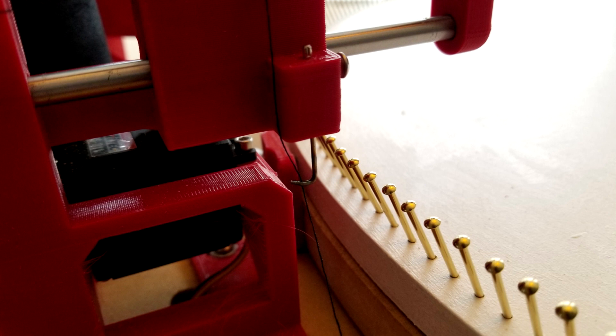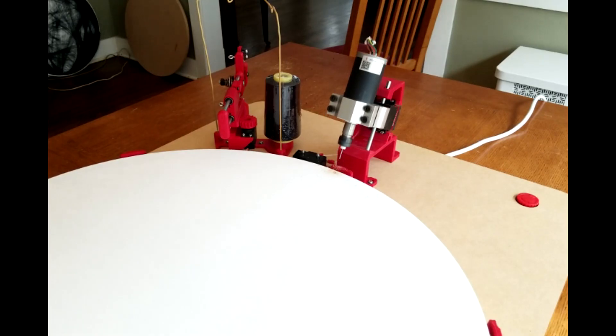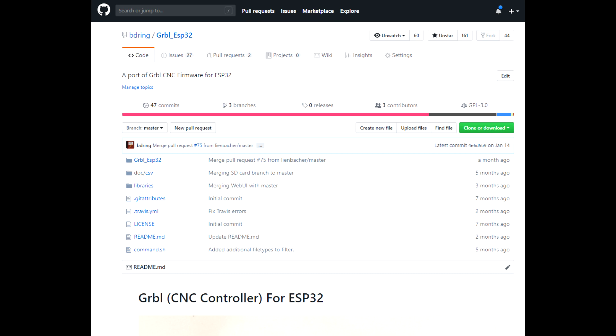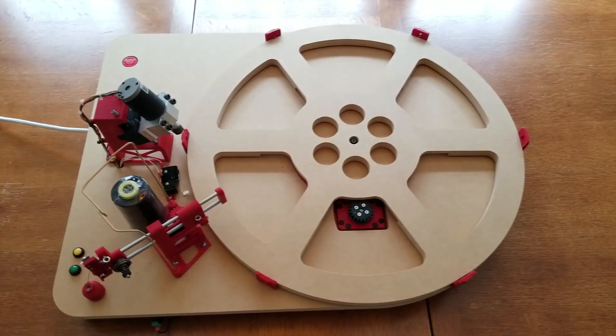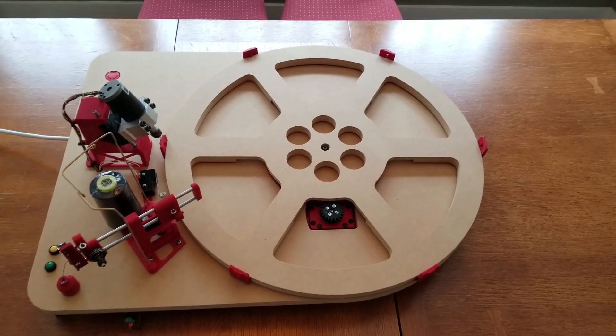I used a passive method to control the thread height: the nails are installed at a 25-degree angle, and the tension of the thread causes it to seek the bottom of the nail. Since drilling a perfect ring of holes at a 25-degree angle is not something a typical router can do, I designed a simple drilling fixture for the machine — a cheap 24-volt spindle driven by a hobby servo. The SD card on the controller has a standard G-code file that drills these holes with a 1/16-inch end mill. The firmware is a modified version of my ESP32 port of Grbl. The platter is the x-axis using standard stepper motor features, the thread feeder is the y-axis using a hobby servo, and the drill is the z-axis also using a servo. Using different work coordinate systems, I can store accurate zero locations for both the thread feeder and the drill.